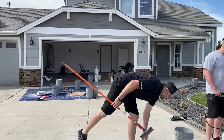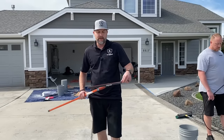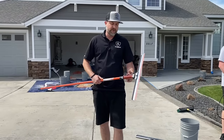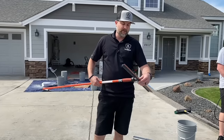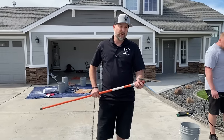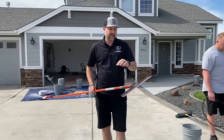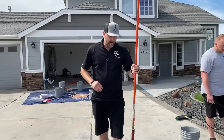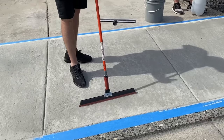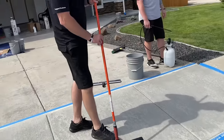And then on these next two coats, they're actually a lot easier to apply because we're just using a squeegee. Now you can get these squeegees at Home Depot, Lowe's. This is a Marshalltown, it's called a Magic Trowel. They have them in the drywall section. You can also order the craft squeegees from Amazon. Those are usually what we use, but we wanted to get the supplies from Lowe's for this project, so this is what you would get. And again, it's gonna go a lot easier because it's a little bit more forgiving. It goes faster because we're using a squeegee versus a rigid metal scraper.